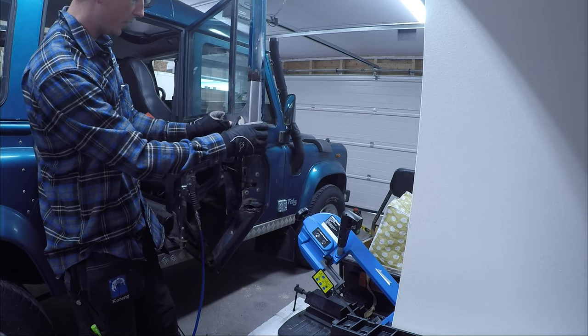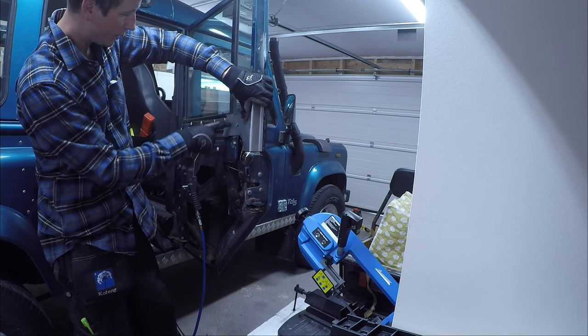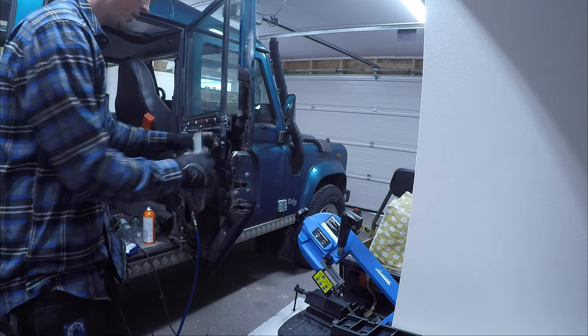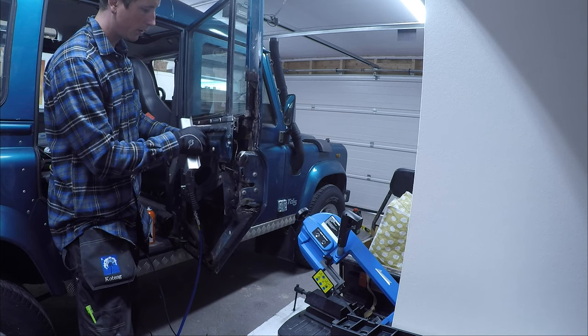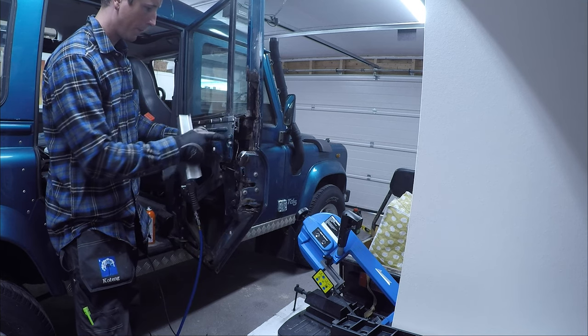After I drilled out for the bolt, the new piece wasn't lying flat against the old internal framing, so I'm gonna cut some more, both on the inside and underneath, so it lays flat against the internal framing. As it is now, it's hitting this rise in the framing and doesn't lie flat.